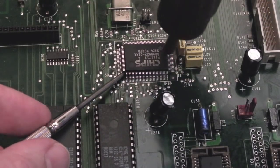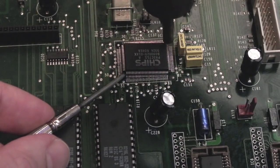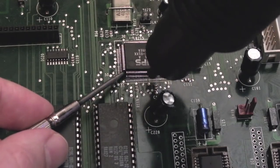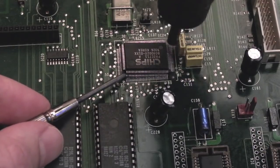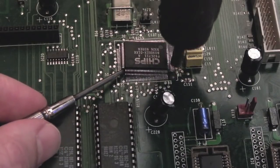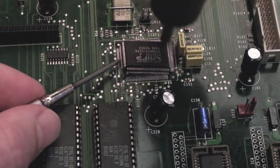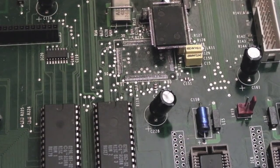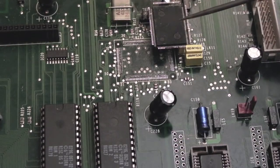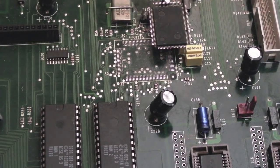It's points like this I wish I'd used chip quick low-melting-point solder. You can see we're almost there - nearly there, come on. There we go, phew! Can you see some of the discoloration under here? It might be nothing more - look at these gray pins - it might be nothing more than needing a reflow actually. But we've got a spare so let's fit the spare.